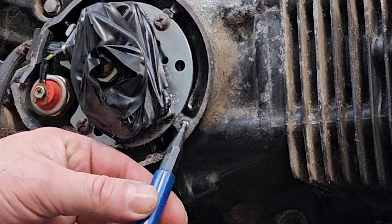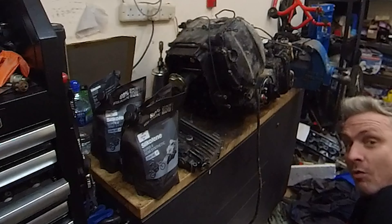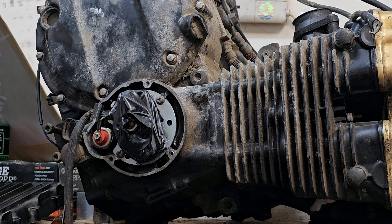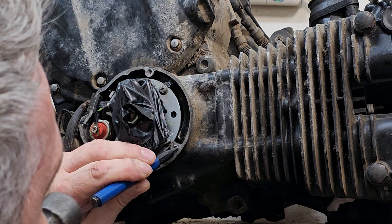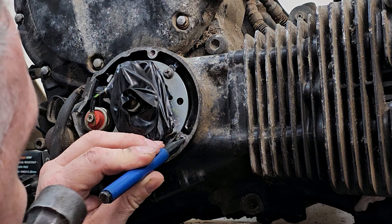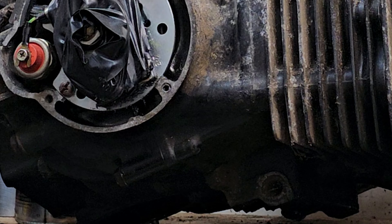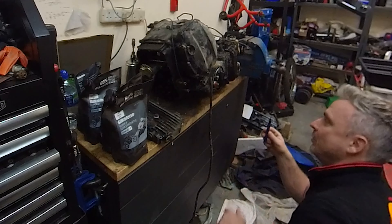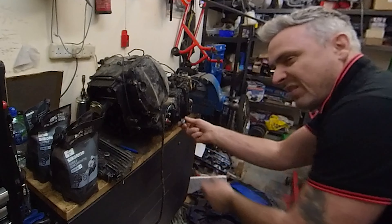We're going to try a few things first. We're going to give it a little tap with the center punch and see if it'll go around — if we can set it off going, the easy out will pull it straight out. That's what I didn't want to happen. I did pretty well drilling right down the center of it but I've left not a lot of meat on the bolt. The top coil of threads has come off so I've got nothing else to really grab. I'm going to try the easy out again — not a lot of pressure. That's going to break. So first I'm going to use a heat gun.